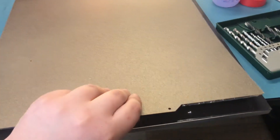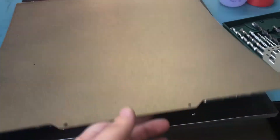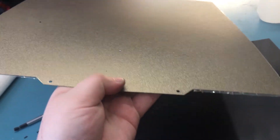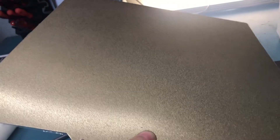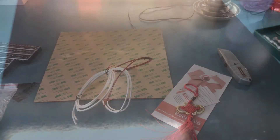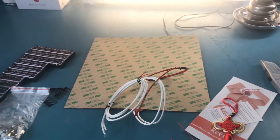It is stuck down nicely and it's holding the spring steel bed well. I'll demonstrate the purpose of spring steel when I get to printing — basically it lets you snap off printed parts without waiting for it to cool down. I've also drilled the four holes needed for the screw holes. I do still need to drill the fifth hole on the aluminium plate but I don't see a point doing that yet.